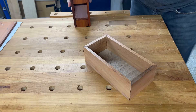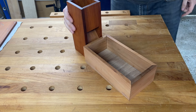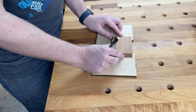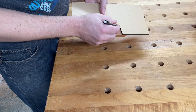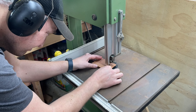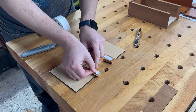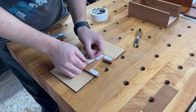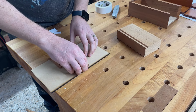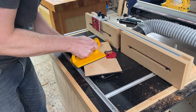So far it's looking pretty good. The next problem is that the dice tray is too tall for the dice tower, so I need to cut out a notch in one end to allow for the opening of the dice tower. I made a pattern with my laser cutter, then after tracing the pattern onto one end of the tray I roughly cut the pattern out on the bandsaw. To clean up the rough edges, I use strong double sided tape to attach the box end to my template so I can use a flush trim bit at the router table. To help increase stability of the small piece, I tape another scrap piece of wood of the same thickness next to the box end, then trim it to the pattern.